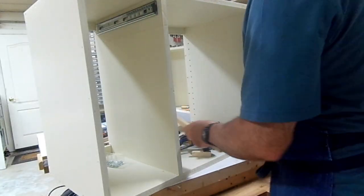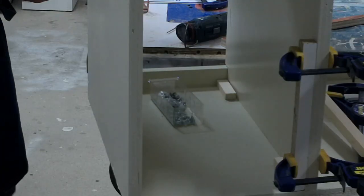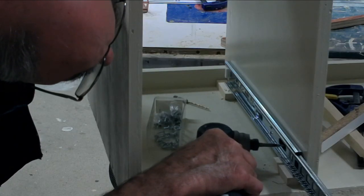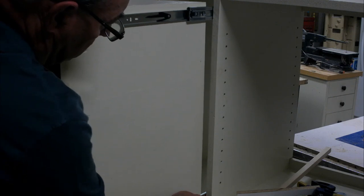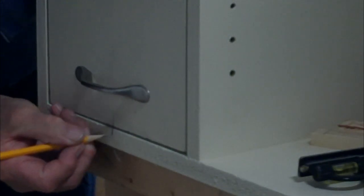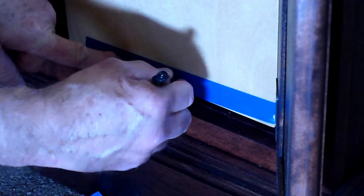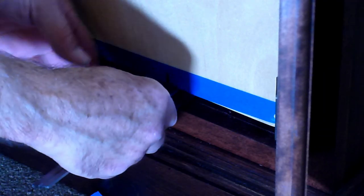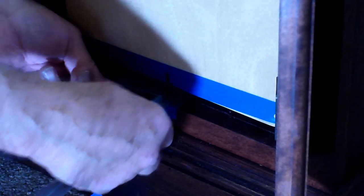Remove the sticks and move your spacer piece down to the cabinet bottom and clamp it in place. I've got a couple of half-inch shims — set one at the front and one at the back of the cabinet, and the bottom slide will sit on these. When the slide is installed, remove the spacers and shims and we'll be ready to test fit our drawer. If you get a good fit, transfer the center mark on your drawer to the cabinet. If your drawer is inset into the cabinet, use a square-cut stick to transfer the center mark and then use the combo square to measure your setback distance. Once the drawer is removed, you can mark this measurement — this will be where you set the front of your slide. Now's also a good time to slip your slide under the drawer and make sure your thickness is right.